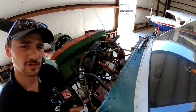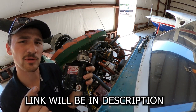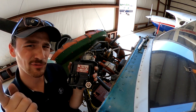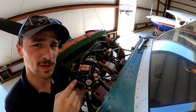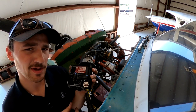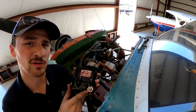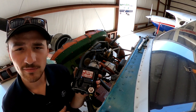I made a video on how to internally time the mag here. I'm going to put it right up here where it pops up. You can click on that to watch how to internally time this mag after you finish this video. I'm going to go ahead and install this mag first, because the prop's in the right spot right now. Then I'm going to show you how to time this mag to the right mag, because I know that right mag's good. Then for the final step, I'm going to show you how to get it top dead center with the Flowerpot.